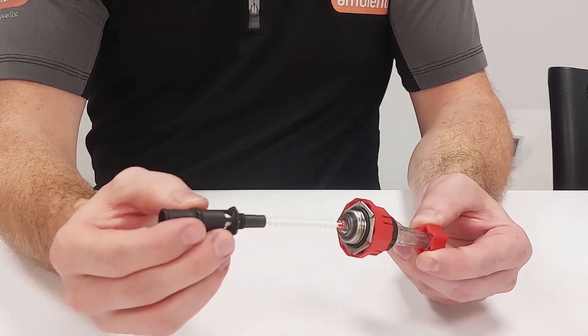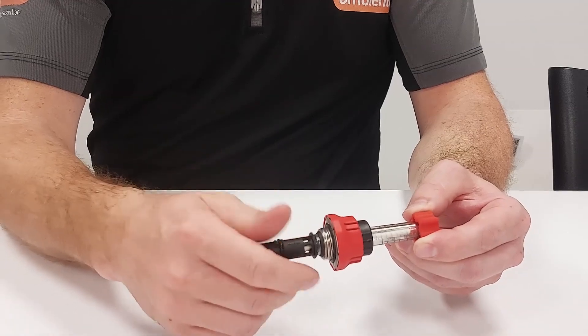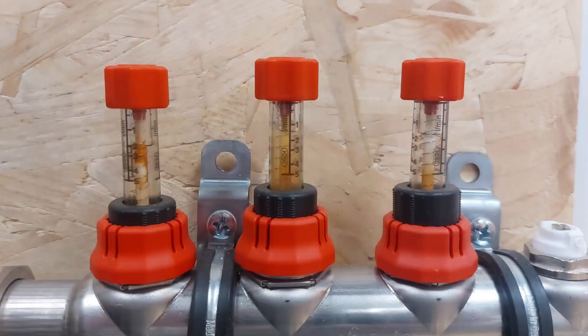Be aware of the springs inside, as they are calibrated to give a certain resistance for flow rate. The system was probably left balanced as per the design, so if you're attending the system, take a set of drawings with you so you can balance it back to how it was initially set up. If the water in the system is really dirty, give it a good flush to get rid of all that debris and build-up — you'll often see sight glasses go orange and brown. Dose the system with the appropriate inhibitor whilst filling up.